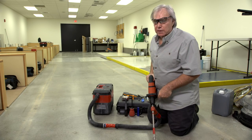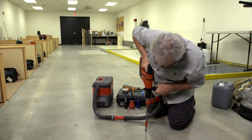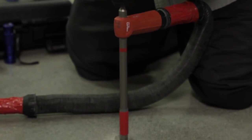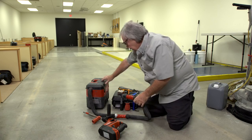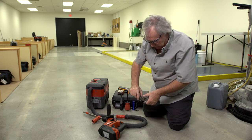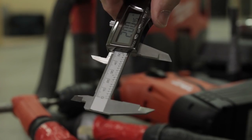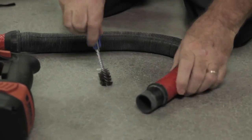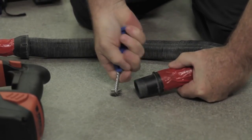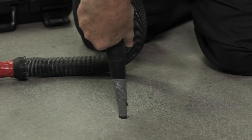Now that we've selected our test site, I'm now going to drill a 3-quarter inch diameter hole to a depth of 2 inches. This is not the final vacuum. I personally like to use a micrometer because of the sharpness of the point that measures the depth. Here you see that the measurement is 2.0065, so it can be no less than 2 inches but no more than 2 and a quarter. I'm now going to complete the final two steps in the cleaning process where I use a wire brush to scour the vertical walls of the drilled hole, vacuum that dust, and then reach to the very bottom of the hole to vacuum dust with the reducer nozzle.